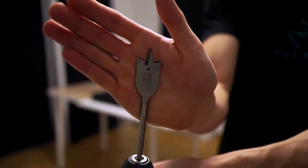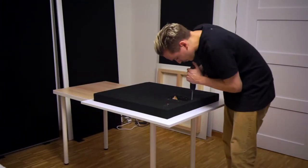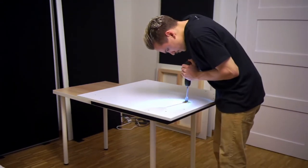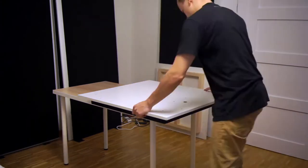I used this 25mm drill bit to cut out the holes for the jacks. It's a good idea to drill from both sides rather than drilling all the way from one side — this way you avoid getting big chips coming out of the material.